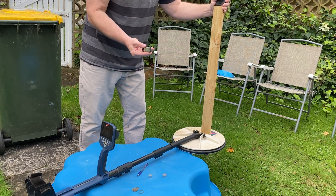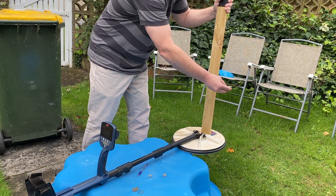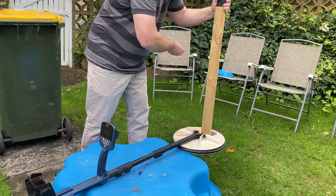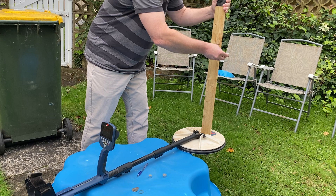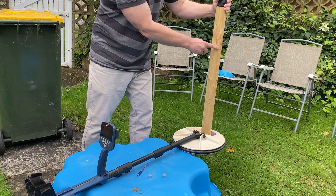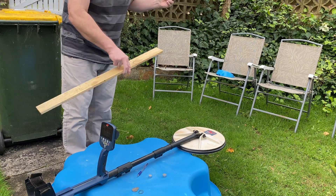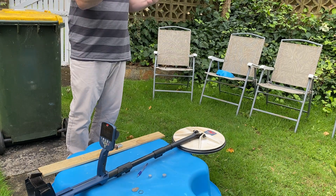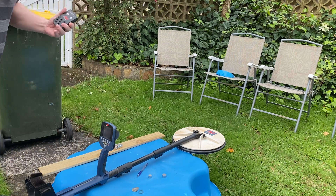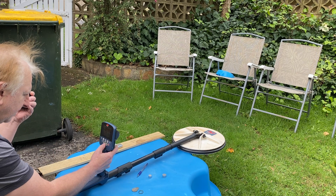I guess I've only got this on a sensitivity of one. Let's try again. It's puttering out there. I was getting it higher before, and I'd say it's a noise issue. We can prove that out. I'll just do a retune on the noise, because I don't want some switch mode power supply in some TV to change frequency or drift and then hit the detector and make it not a fair test.